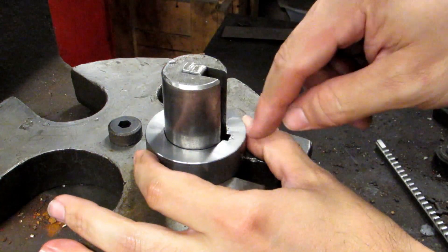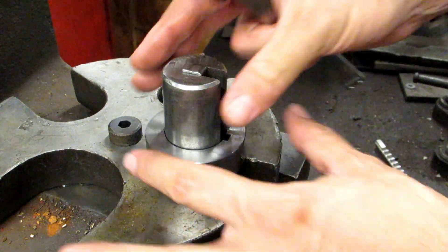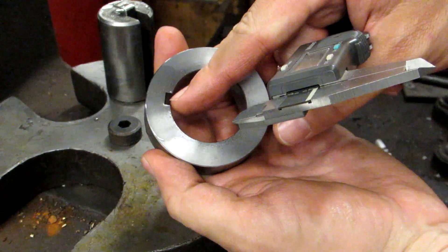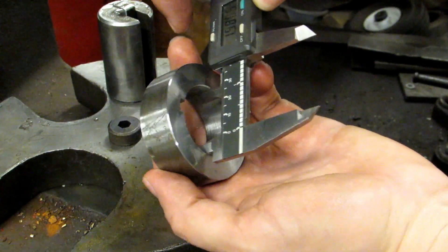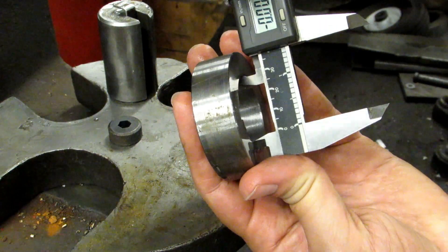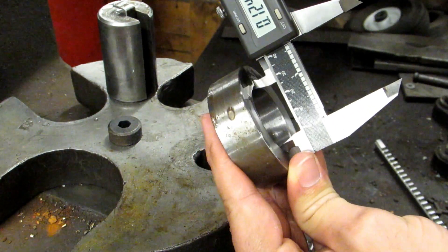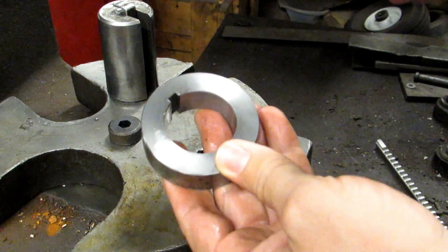So right now I've got a pretty healthy keyway there. I'm going to take it out and measure it. I did another video where I talked about using digital calipers as calculators and this is another application of that. This is a quarter inch key so it should be an eighth of an inch deep. If I go ahead and measure my bore here and zero my digital calipers, now it's zeroed on the bore, I can then go ahead and directly measure the depth of the keyway — which I'm just about there at 124.